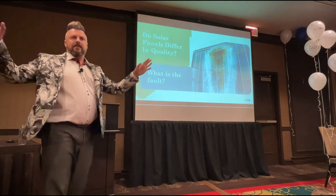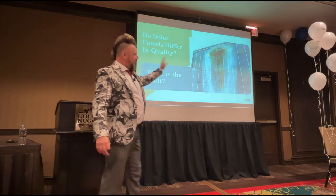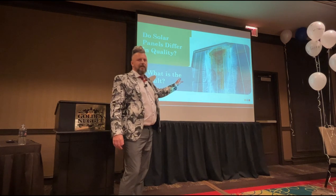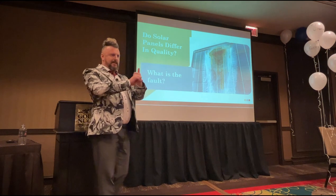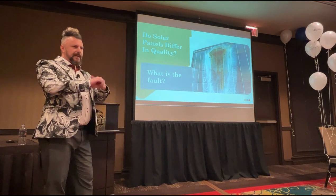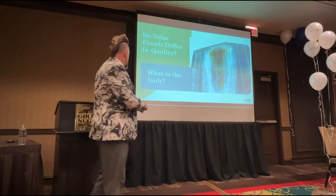We're on this glossary of terms and things. Key things to write down. Here's another key thing to write down. Whenever you see brown on a solar panel, that's bad news. Okay? Anything brown on a solar panel is bad news. It's indicating it's either overheating or there's water in there. Anything brown on a solar panel is bad news, okay?